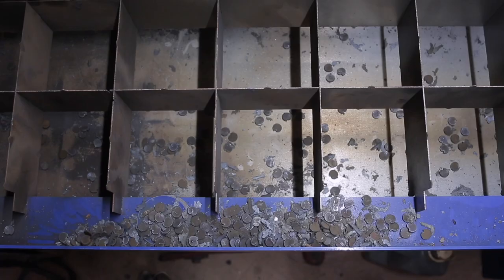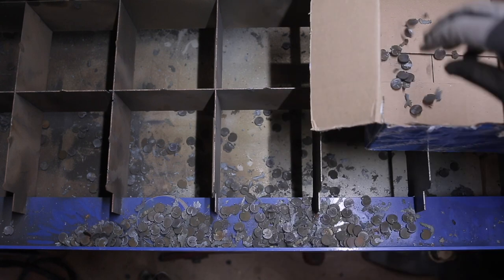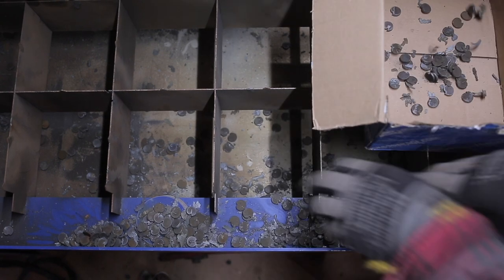Okay, still a ways to go. I'm obviously not removing the brace bar until the other side is done and I've added another brace to the second roof rib. That one supports the D-pillar, which in turn supports the sliding door, so it's a daunting one. It's much beefier.